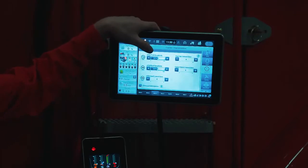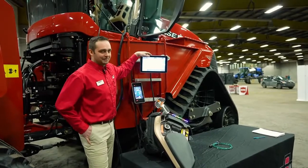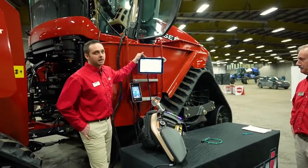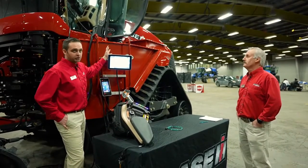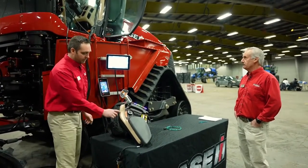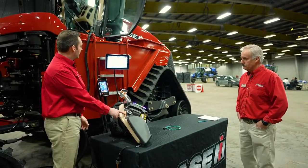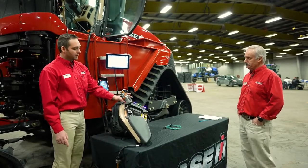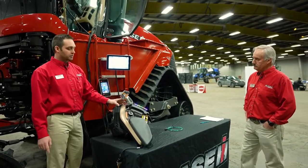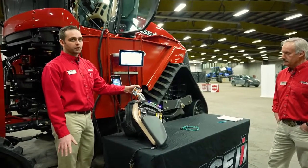What's APM, Louis? Heard you know lots about that. Automatic field performance, productivity performance. Yeah. So APM stands for Automatic Productivity Management with Power Drive, Power Shift tractors. And again, I reference these buttons down here to turn on field or road mode. So basically, you can program using this multifunction handle the speed you want the tractor to drive at, and you will let the tractor do the shifting for you.